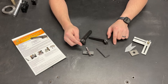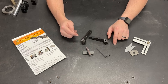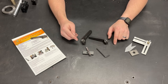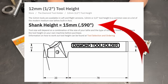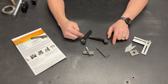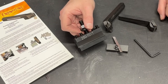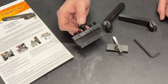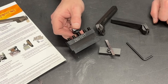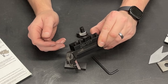The description that I failed to read specifically said that the half-inch tool holder has a 15-millimeter shank on it. There is a smaller tool holder that would have fit in my AXA tool holder, but I didn't read all the information — and it's not like it was fine print. It's in big bold letters that the shank is actually bigger than the cutting size. The fix is simple: get an oversized AXA tool holder, a 250-101T. I bought this one on Amazon for about $15, and now this tangential cutter fits beautifully.